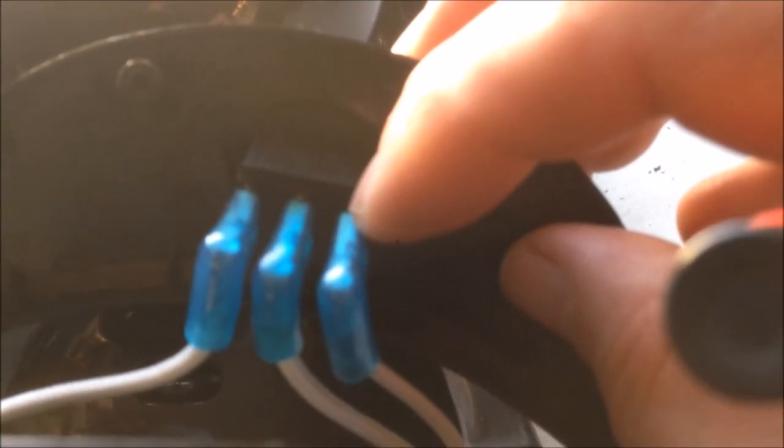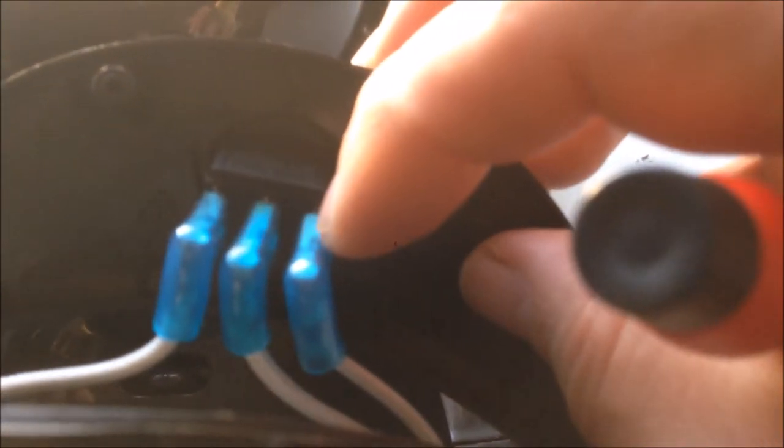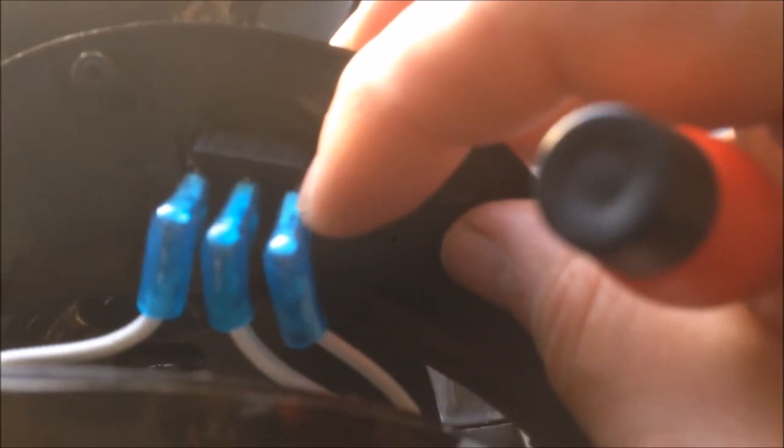And the indicator should be a neon. So when you have the live in the middle and the neutral on the right connector, the indicator should light up if it's working. In this case, the neon stopped working, but the switch is still fine.